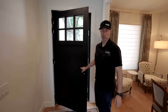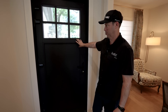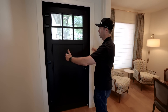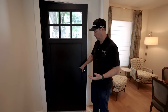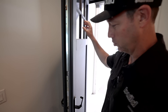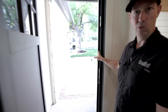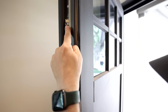It's pretty typical to buy front doors from the same manufacturer as the window and door package, but this is my first time ordering a European door. Check this out — it looks like a bank vault. This was built by Shuko and custom built to the architect's specs, kind of a weird size like three foot six by seven. Still UPVC, crazy thick, triple glazed, super insulated. It's got two weather strippings — one on the door itself and one on the jamb — so when this seals, it's just super, super tight. And it's a multi-point locking system, kind of like the windows in the house.